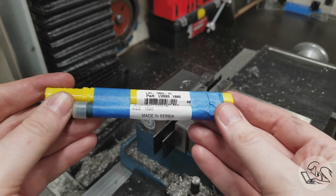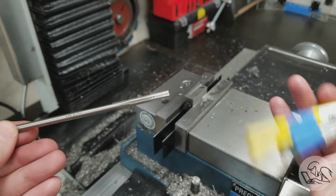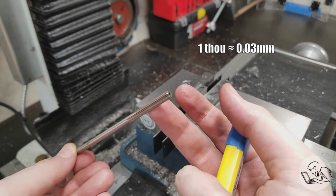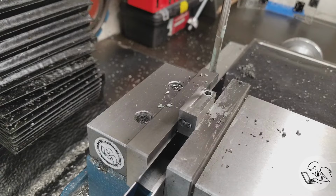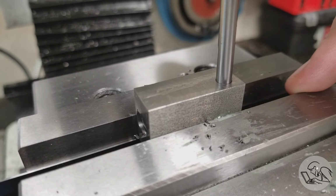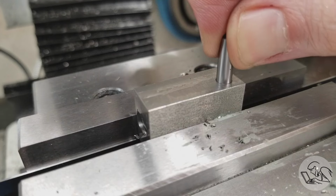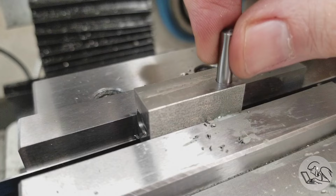So I've got the over-under reamer set here. I'm going to grab the oversize one, and as you can see, it's clearly 1 thou oversize, and I'm just going to open this hole up 1 thou. And you would swear that nothing happened when you do this, but now check that out. Mercy, that's a perfect fit. Oh, that's an RC3 all day, maybe even RC2. Over-under reamers are the secret to looking like a hero in a hobby shop.